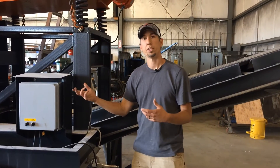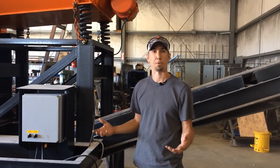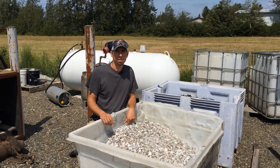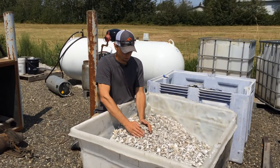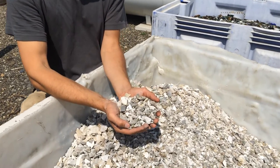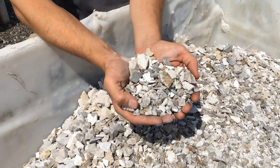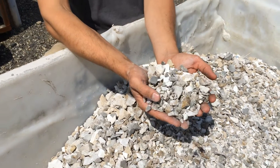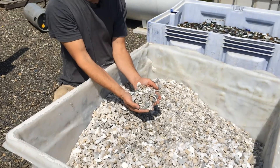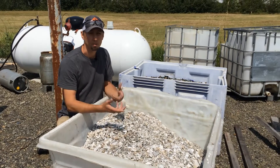So with the diesel engine and then the ability to run off single-phase power, you can really run this unit in any gravel pit or operation anywhere in the world. You do not need three-phase power to run this unit. So here's the results from us crushing our sample through the jaw crusher module. This again is a combination of granite countertops and quartz pieces. We also had some of those big quartz boulders in there to kind of mix it up a little bit and essentially run two samples at once, but you can see that the crush is really nice. It's almost all under one inch probably with quite a bit of fines in there, and we have the jaw crusher set as fine as it'll go on this particular machine for the customer spec.